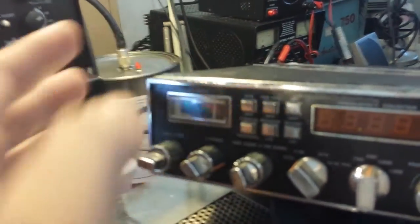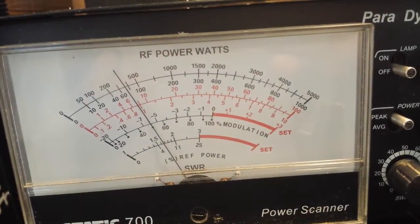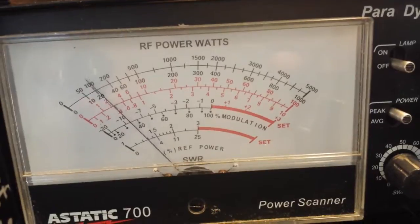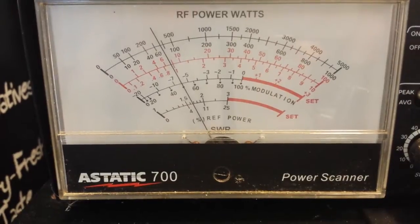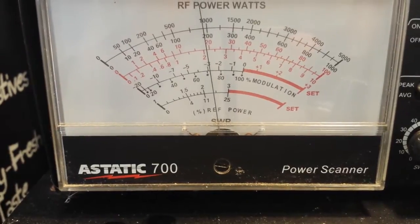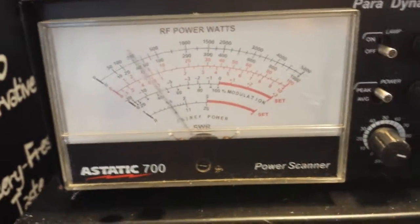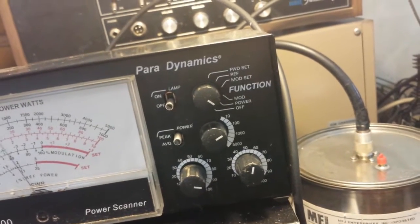Okay, now let's go to high. Power to high. As you see, it's dead keying about 8 watts. Okay, 8 watt dead key. Oh dear. So you got an 8 watt dead key swinging about 18. Take a look at it on the amperage meter over here. Oh yeah. Okay. It is swinging forward on the amperage meter just a little bit, so that is good.